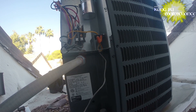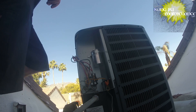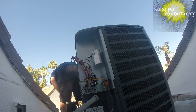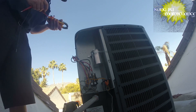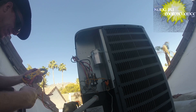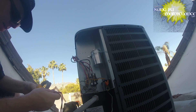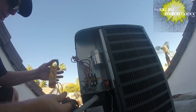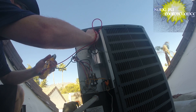Got my meter in, we'll test that out. Discharging the capacitor just like that. I'll probably be checking a few other units while I'm up here to get ahead of the summer. I like this Field Piece meter — one of my favorites. You can find a link for it in the description below. This one tests microfarads, which is critical for AC work.